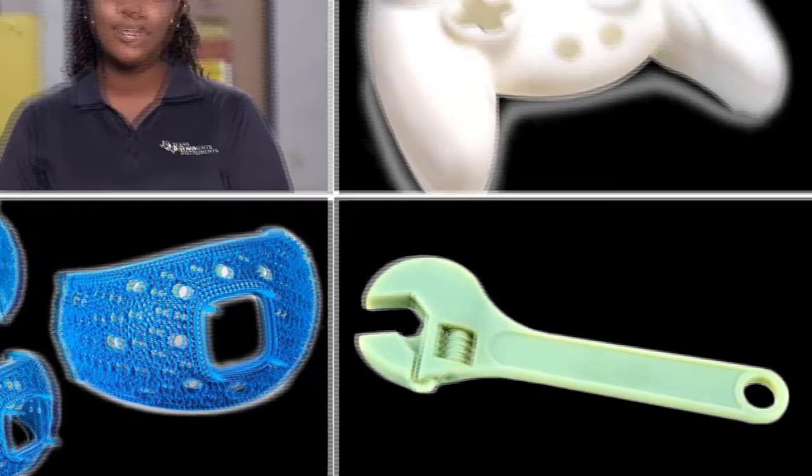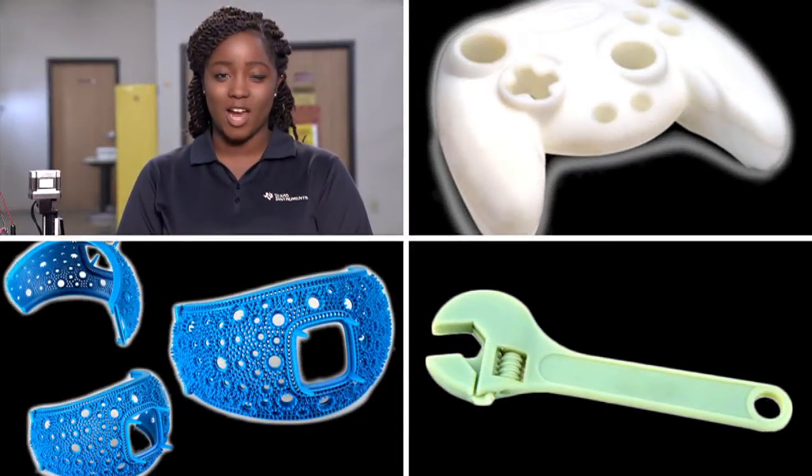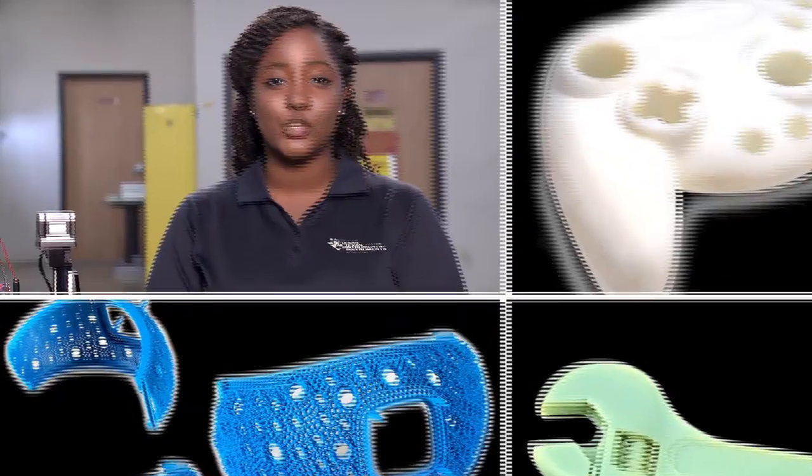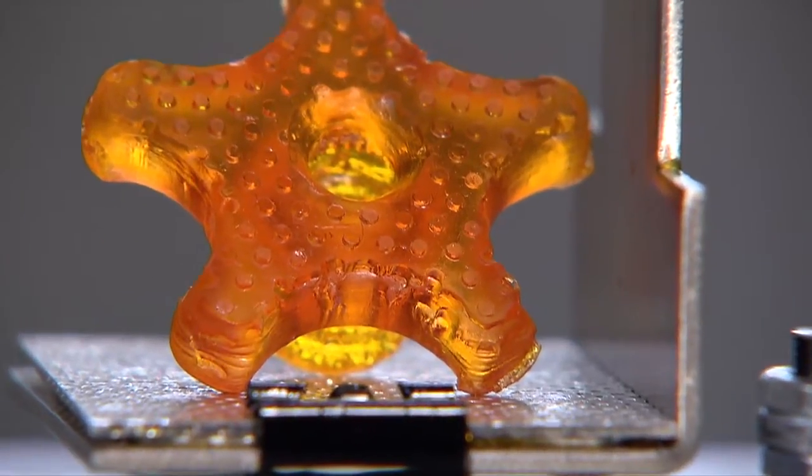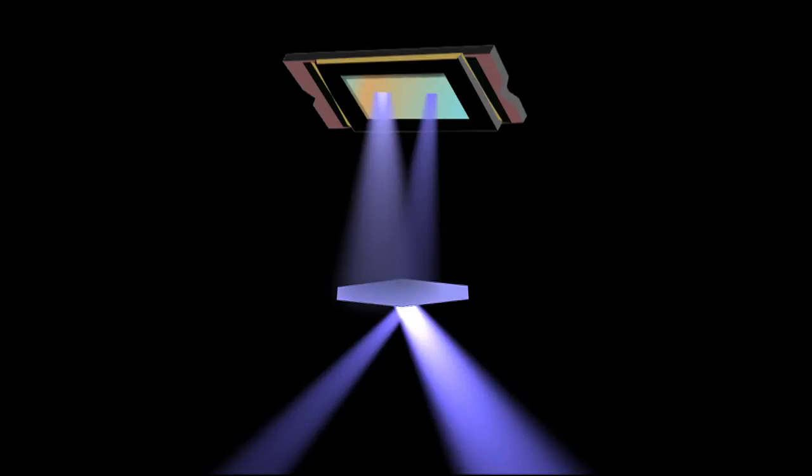For prototyping, tooling, casting, or direct part manufacturing, DLP technology is a choice for mass production manufacturers and hobbyists. A 3D printer powered by DLP technology is compatible with a wide range of resins, prints fine detailed objects, and can scale images for larger prints. With this DLP system architecture, the micro mirror array exposes an entire layer in one shot, meaning a faster build independent of layer complexity and detail.